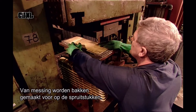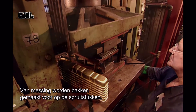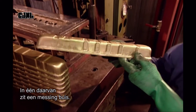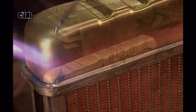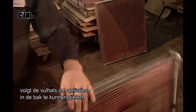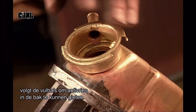Workers now feed a sheet of brass into a press to form the tanks that go onto the headers. One contains a brass tube — hot transmission oil enters one end of it and exits the other, cooling along the way. Once workers finish soldering the tanks to the headers, they solder on what's called the filler neck, a spout for pouring antifreeze into the tank.